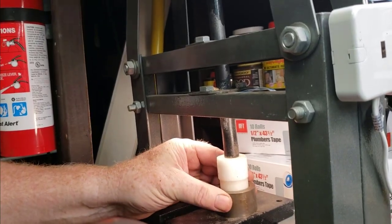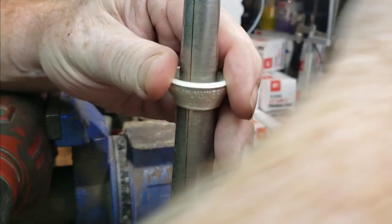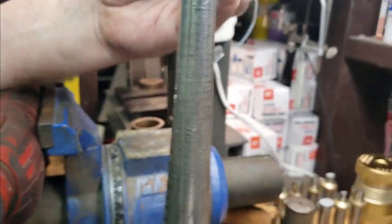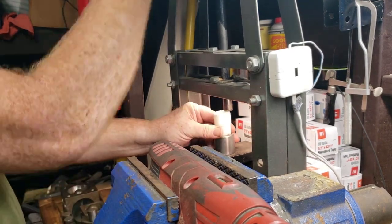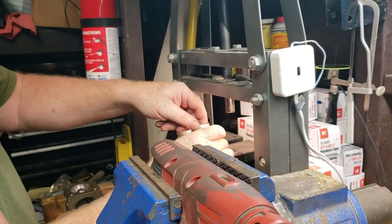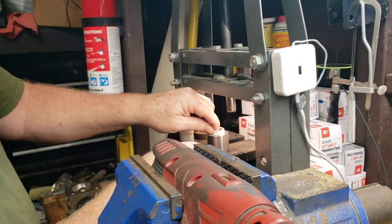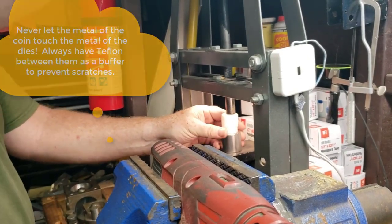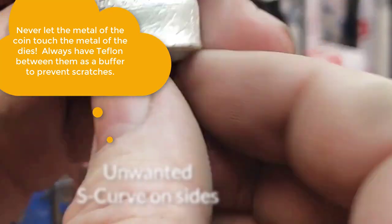Make sure that it's set perfect. I'm putting it inside the die without any Teflon tape initially because it's only touching the very top rim. I'm going to use this mandrel to stretch it out and get it beyond the size I want. Our goal size is size 9, and I'm going to bring this to about a 12, maybe 13 — just check it frequently. You can see I'm on a 13 right there. We're going to put about 20 to 25 wraps of Teflon tape around it, and that's when we move over to a Swedish die, which is only a 17-degree die. Keep going back and forth, flip it upside down after you get the cone shape inside your ring. As needed, if you see that you need more Teflon, keep adding more Teflon.